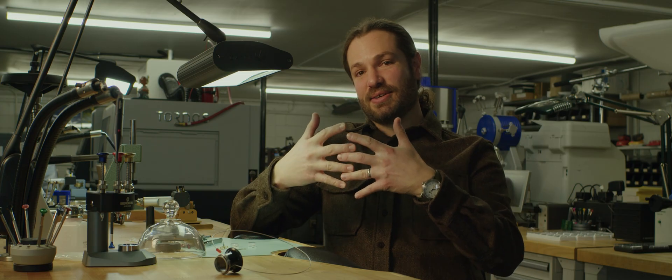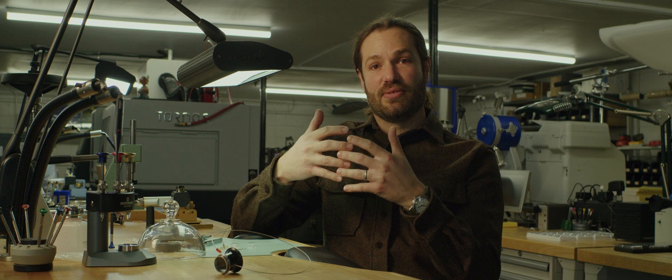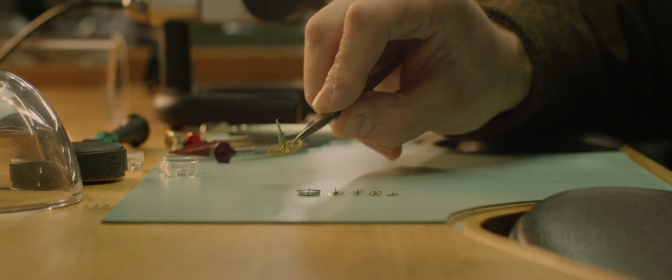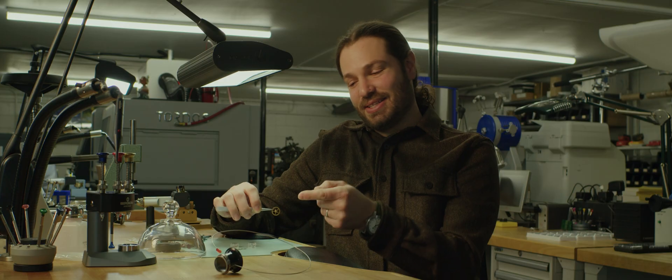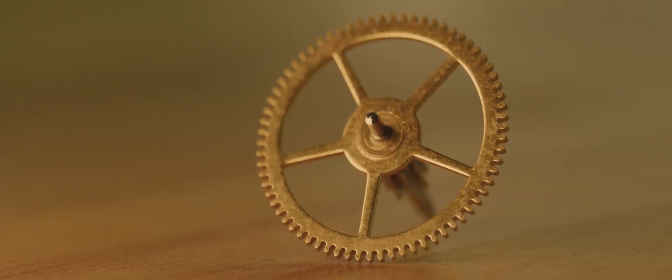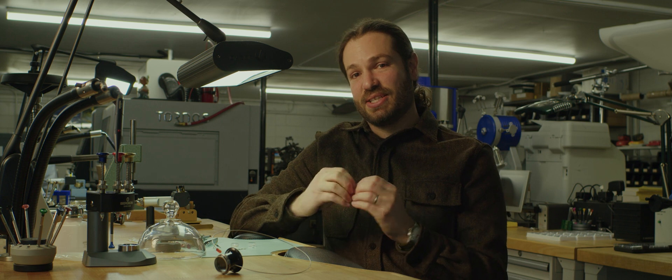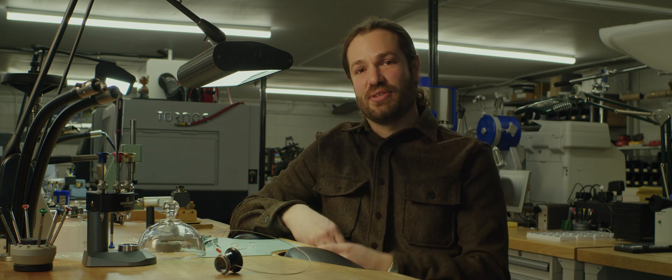As the teeth rub together in a watch over the years, you're going to have some sort of metal flaking off. If the teeth of the brass wheel were gold plated, you'd see gold plating coming off those teeth as they wear. So on a gold-plated wheel, we have to put the wheel back onto another machine that only polishes the teeth and removes the gold plating from just the teeth. The top and bottom of the wheel will still have the beautiful protective gold plating, but the teeth will not, so it won't flake off into the movement.